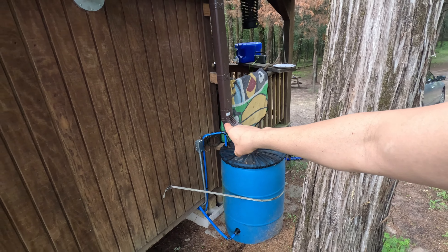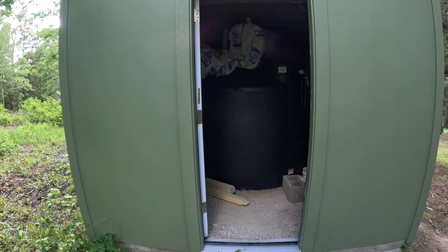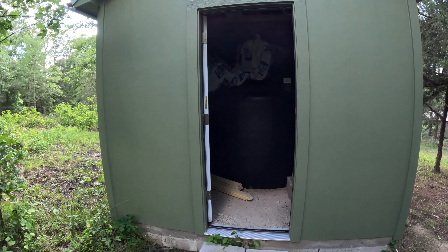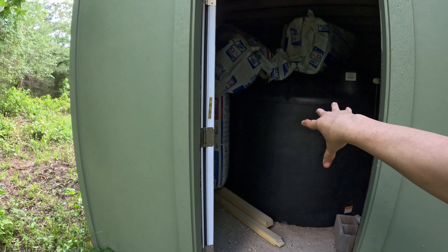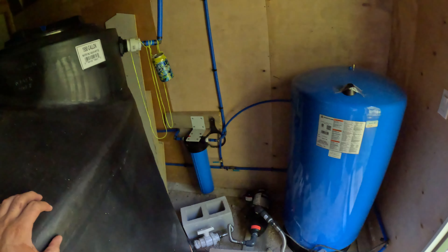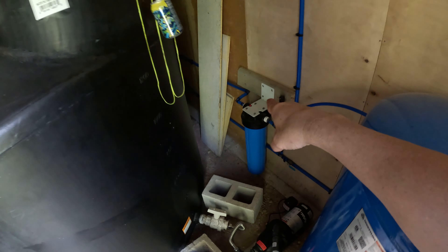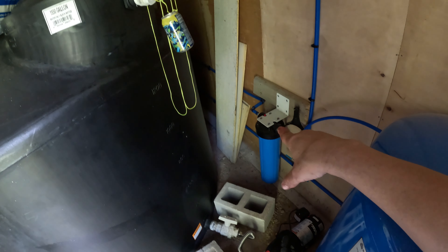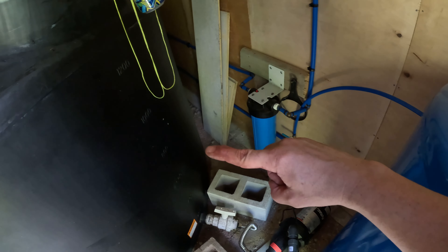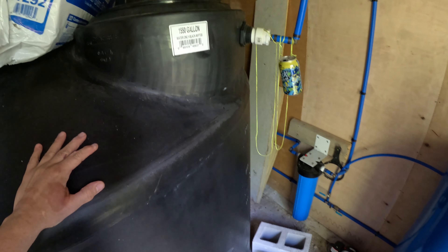It's very important to mention that this 12-volt pump is fused inside the cabin. Inside the tank house — it has a tiny door — you can see the 1,550-gallon huge storage tank. The line coming from the outside pump goes to a 30-micrometer, 20-inch filter. This is the third level of filtration, to make sure all the water pumped into the big storage tank is filtered.